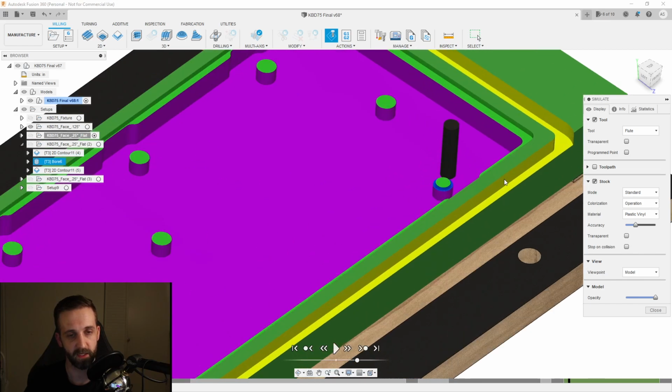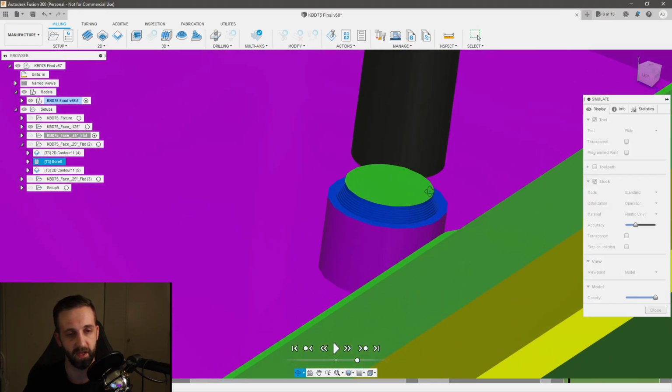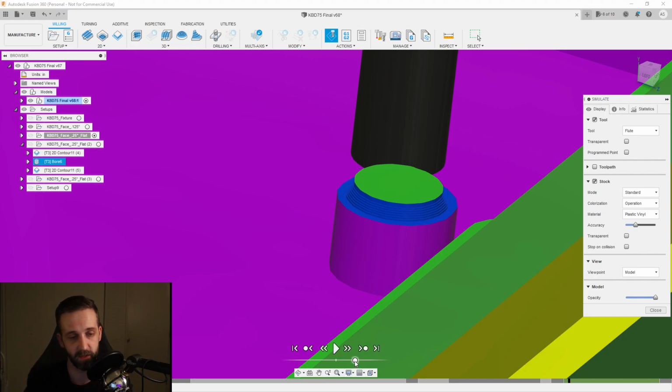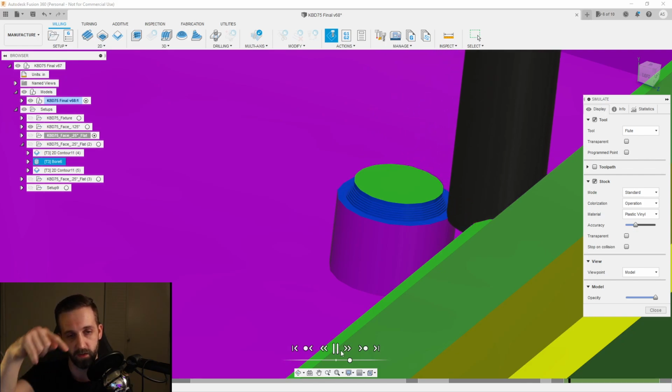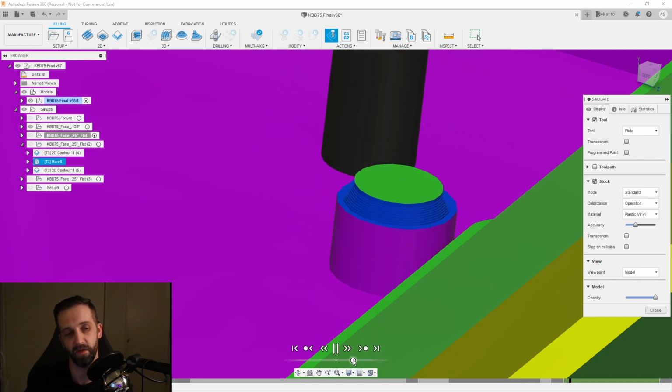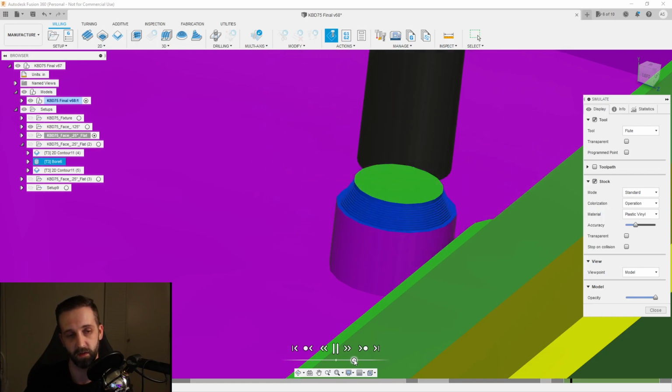And then this is actually really interesting. So now what I did was I gave myself the taper on these. Now the proper way to do this would be with like a chamfer bit or a round end mill. But I chose to do it with a flat end mill because these features are so small that you're never going to be able to see these ridges. So I ended up spiraling down, cutting a small chamfer on the end of each one of those.